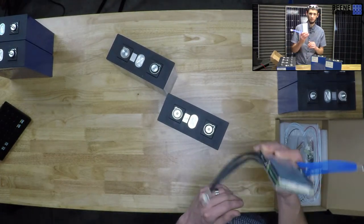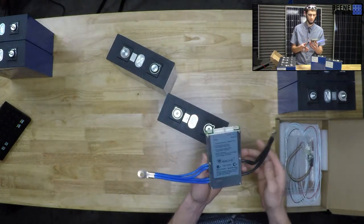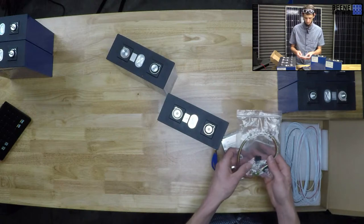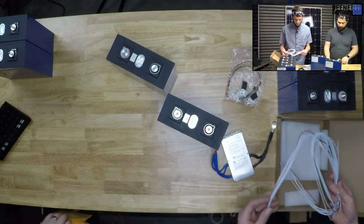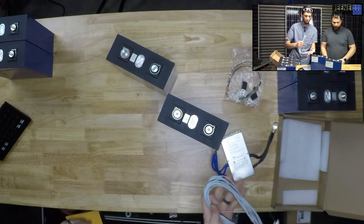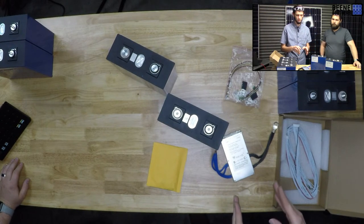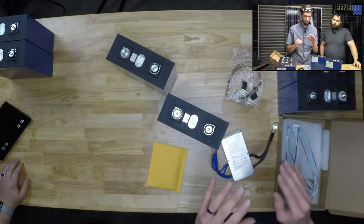Let me go back to the BMS. This is an Ant BMS, a Bluetooth BMS, which means it is also configurable, which is something I appreciate. When we grab one of these BMSs, we pair it with all of the ring terminals needed to get onto the cells of the battery. And you've got your 17 sense leads here. For us, we'll need to look up the diagram to find which leads go where, because if it's 8S, I think we're using 10 of the leads, and you'll see how those connect.